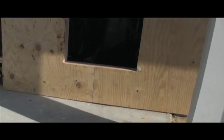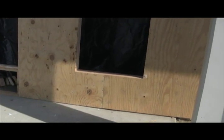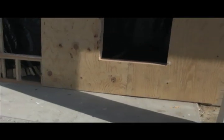What we're going to do is use a 12-inch nail-on flashing product around the perimeter of this window. We're going to start at the bottom and work our way around. You can use a 9 or 12-inch product. We prefer 12 over 9 but either one is fine. Don't use 6.